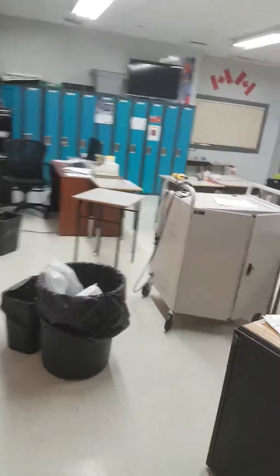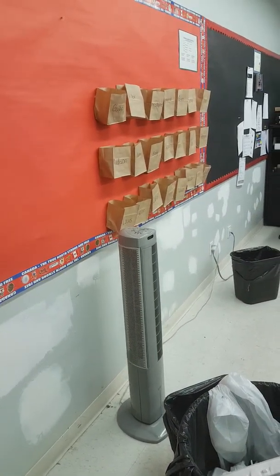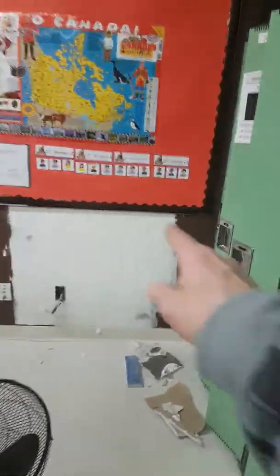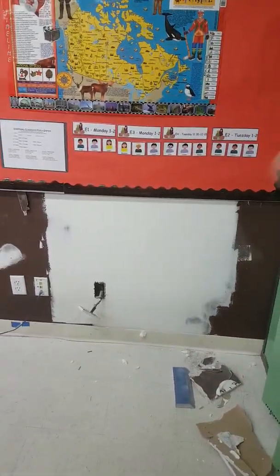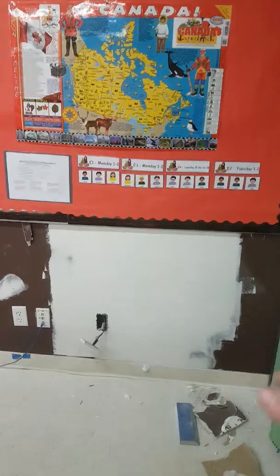In J2 here, this is the one next door. We've gone through a process of fixing all the dents and dings, give it a refresh. This was the one area that had a very big dent. So we've chopped out the piece of drywall and replaced it — you can't just put mud on those areas. It needed to be cut out, and so we've done the repair there.